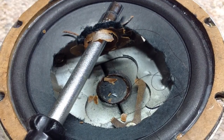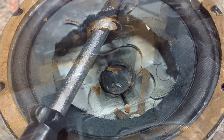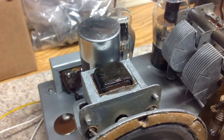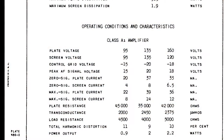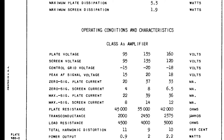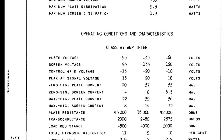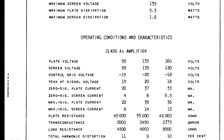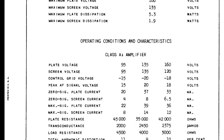So knowing I had more turns or more length of wire, I decided to check the output transformer and identify the turns ratio, which ended up measuring 40 to 1. Squaring 40 gives me 1600. Reviewing the tube manual for a type 43 tube, the load resistance for my design would be somewhere around 4000 ohms. If I divide the 4000 by 1600, that gives me a desired design impedance of around two and a half ohms and a voice coil DC resistance of approximately 1.8 ohms.